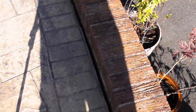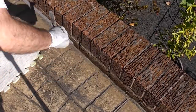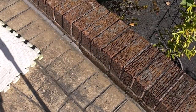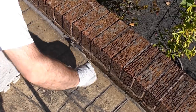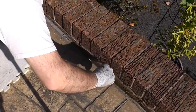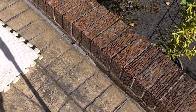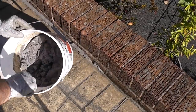In this example there is a large gap between the driveway and the wall. When it rains the water pours into the gap and drains onto my neighbour's property. Whenever you get a gap like this you must fill it. Do not try to point over the top of it, or water might get in and freeze, then break up all the pointing — or worse still it could move the wall even further, which eventually might need rebuilding. I'm filling this gap using the finger pointing trowel, ensuring that I press the mortar down so that there is no void. I'm filling the gap first, then we'll point the fillet afterwards. When applying the mortar I normally press it against the side of the bucket, then scoop up some mortar on the end of the finger pointing trowel and push this into the gap.